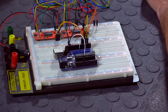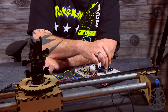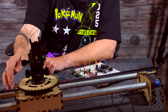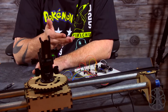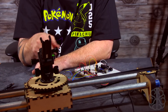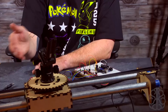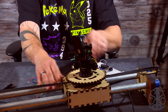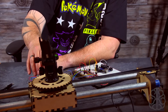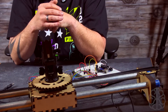What we're going to do today is control both of these steppers by inputting values into the serial monitor. The Uno is connected to the computer, and using the serial monitor we're going to give them move positions for the slider and the rotation. This might be a multi-part tutorial — this one will only show how to input values from the serial monitor to the Uno. In upcoming tutorials, we'll make it more complicated, calculating speed and acceleration automatically depending on the move values.